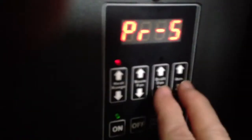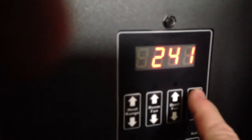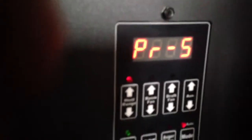And there's a pile of pellets there, it's not burning, which is telling me that the intake air needs turned up a little bit. I did the adjustment as they recommended on the low end, and I've got it at 240. I'm going to take it to 250 and see what that does on the low end.